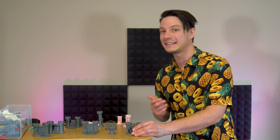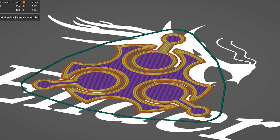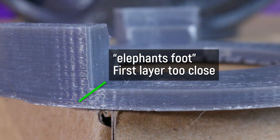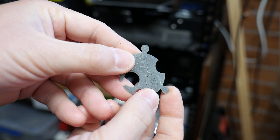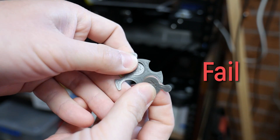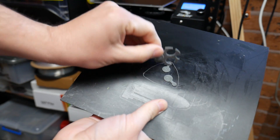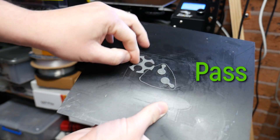In this pack you'll also find a clearance card, which is a mega simplified quick-printing test of first layer accuracy. Some squish is to be expected — you can compensate for it in your slicer, and I actually have a whole video on what's called elephant foot if you're interested — but too much and the parts will just weld together and won't work. They need to all come away cleanly from each other, and if you can achieve that with the clearance card then you're good to go.